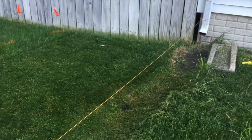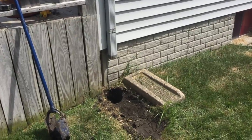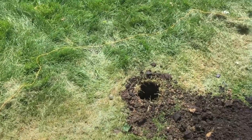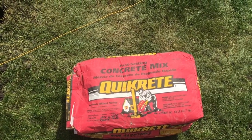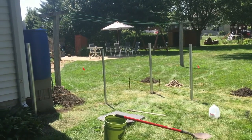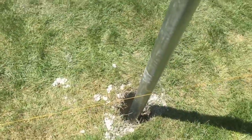I'm at the point where I'm digging holes right now. The holes are dug on this side and we're going to use Quikrete fast-setting concrete mix — sets in 20 to 40 minutes and ready to work with in four hours. All the poles are set in concrete and I've got them run along the string line, set to the right height, and we're ready to go.